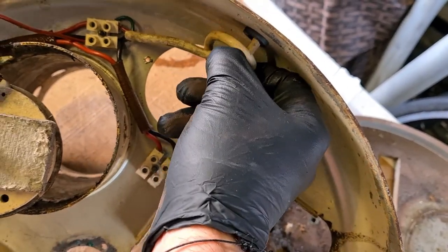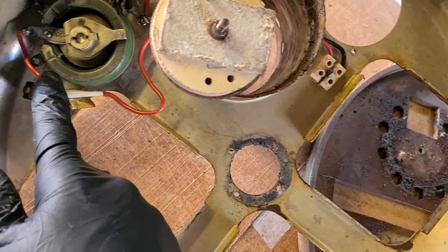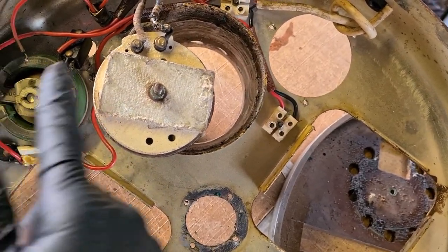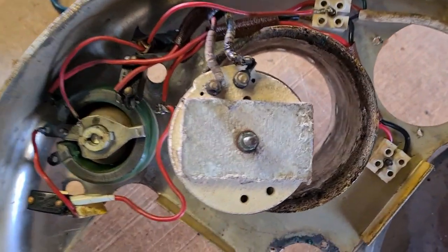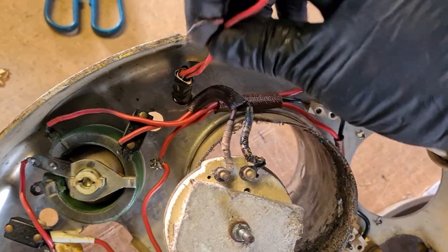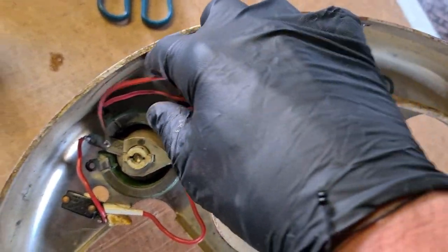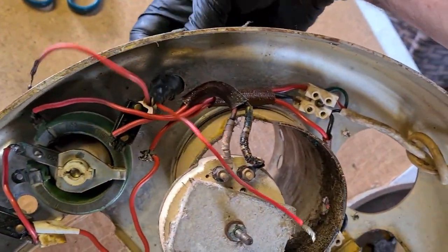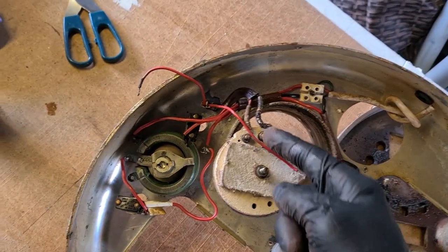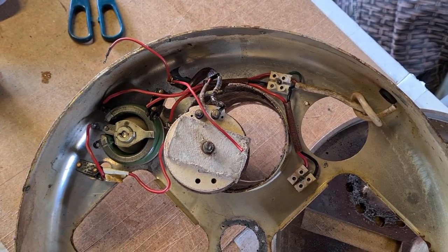There's a nice knot in there for safety. I'll disconnect all these little bolts and I think I can pull the handle off the top and hopefully all that can come away so I can work on replacing everything — a like-for-like new wiring job. Someone's had a good go in here before me, which is a bit worrying seeing as everything's 240. The wiring for the LED light: one end was at what I presume is the earth from the plug, and the other end was wired into a positive feed. It's a bit worrying — all this is very close to bare metal, and these little connections are very close to making the entire casing live.